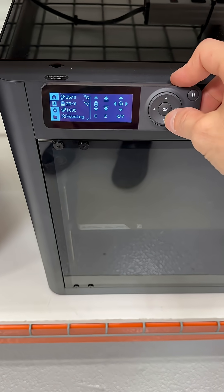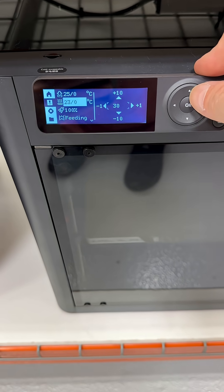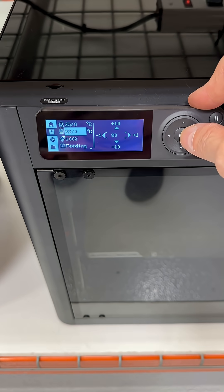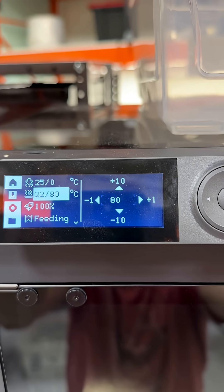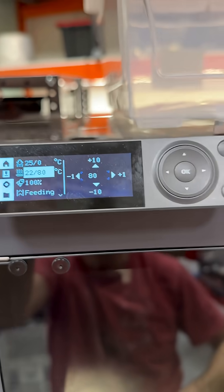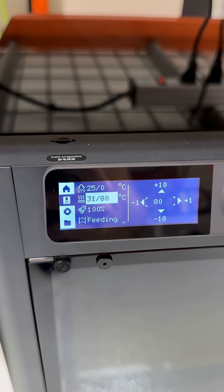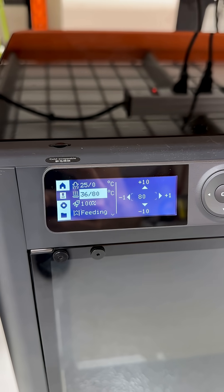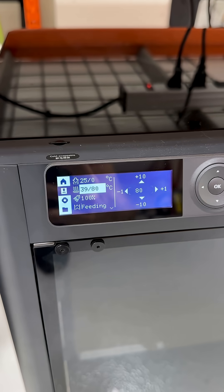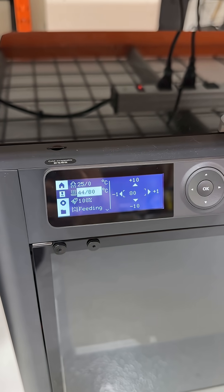If we go and change the temperature of the bed and set this to 80 degrees and go, and then this one also 80 degrees — you can see they're both starting at about 22 degrees. So go. This one is climbing like crazy, and that would be because the bed runs on mains voltage and we've effectively doubled the power because we've almost doubled the voltage.